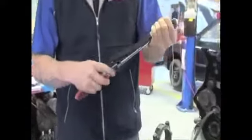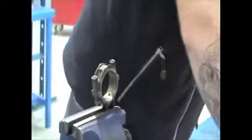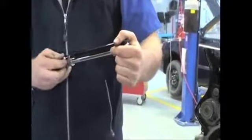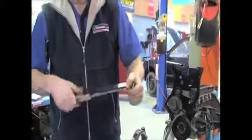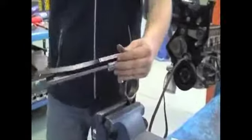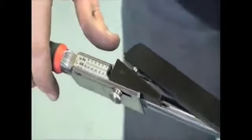And this is just a gauge that's going to show you, make sure you've got the correct tension. So this one works. You just put your socket on the end. This is a connecting rod out of an EA Falcon piston on the end. You simply just put it on there, do it up, and then once it reaches, in this case, 20 foot pounds, it's going to click just now. You always do it a couple of times to make sure you've got the right tension. I know now that that bolt is done up to 20 foot pounds of torque.